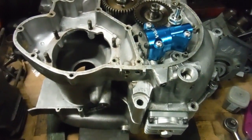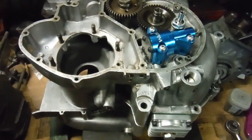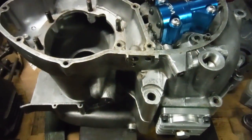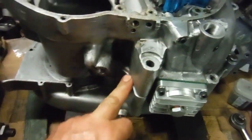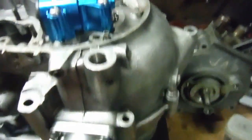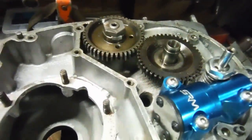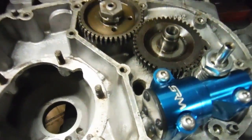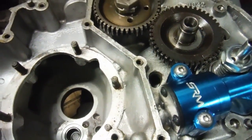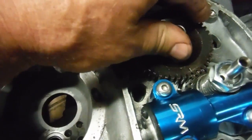I've got the crankshaft in what I'm going to call the jigsaw A65 engine, for obvious reasons as we saw in my last video. I've got the crankcases all bolted together tightly, gasket sealant on the faces between the two, and the sump plate, oil pump, camshafts in and everything. The owner — I never heard it running, it just came to me in bits — said it'd be making noises and he suspected trouble around this intermediate gear.